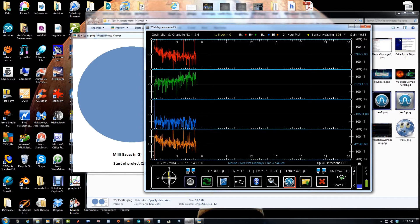Down here you can mute all alerts. It's got power monitoring — if you drop below 4.5 volts, it'll notify you, just in case you're running on batteries or on USB power where the voltage can drop if you have a lot of devices on your USB bus. I've got a healthy battery status. This button will mute the warnings and alerts, and this will reset the plot.